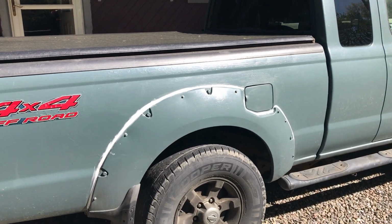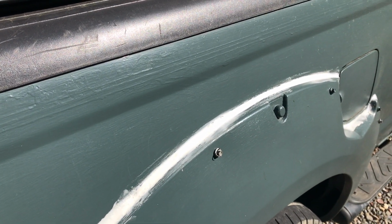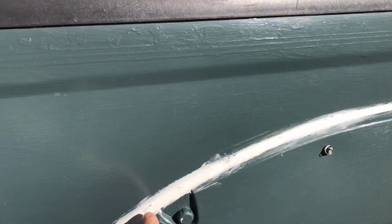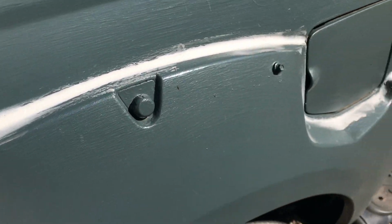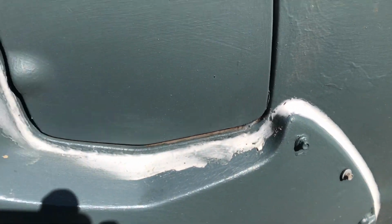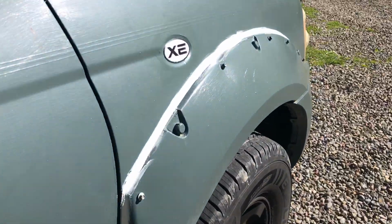So I noticed last year, well, in the spring, that where I had caulked these so no water could get in there, it had broken the joint in some cases. So I went back through and added more screws, and then I re-caulked it with the latex silicone paintable caulking. Went all the way around, did that.